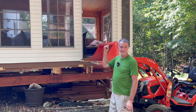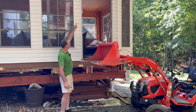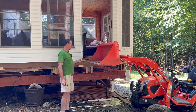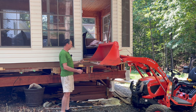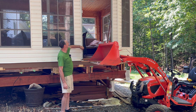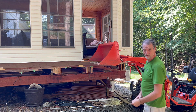Started doing the removal of the door and I forgot to set you up. What I basically did is — there's four hinges. I undid three of them, kept that top one. I slid a board here and had my foot there, holding on to the door, and my wife unscrewed the last two screws. Then it just sat on the board because I had my foot there, and I dragged it inside. Now what's left is to remove the trim. I've got to go underneath the J-trim up there to remove the screws there also. Then I'll be ready to start framing.